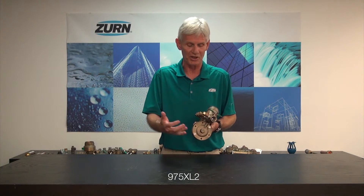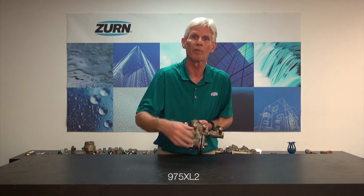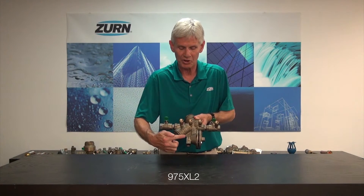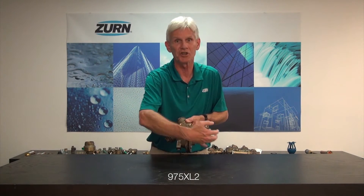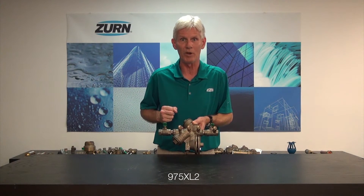There's an additional reason to have that hole, and that is that both sides of this relief valve have to be perfectly in balance. When the relief valve stroke is closed, I have a certain amount of the seat area that's exposed to atmosphere. Conversely, I have to have the same amount on the other side of the valve. So there's a valid reason for having that weep hole there.